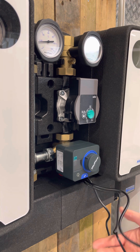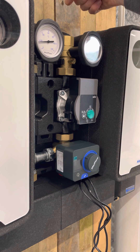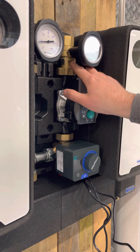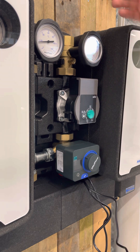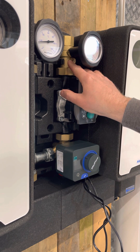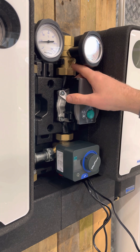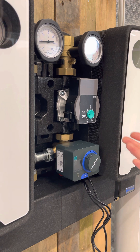Once you've wired up all your connections - your outdoor sensor and your flow sensor which goes on the pipe up here - you'll strap your flow sensor to it with a zip tie or similar. There is an option to buy an adapter that goes in just underneath the flow isolator to put the sensor into, but my personal preference is to strap it to the pipe above so people know the sensor is there, and you also guarantee no leaks from that connection going forwards.